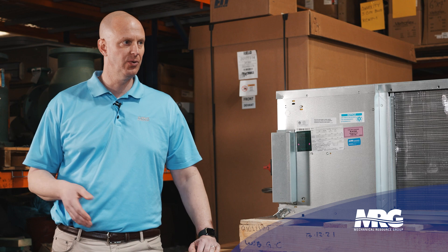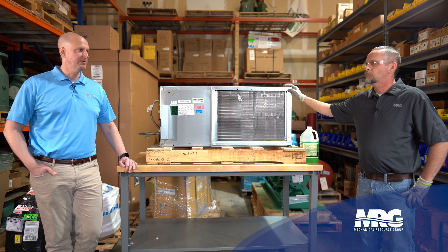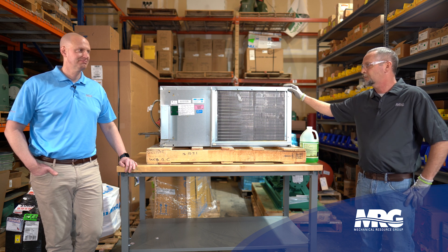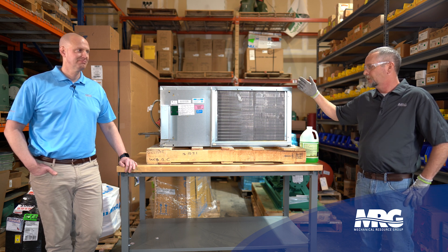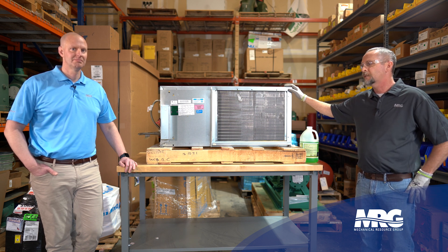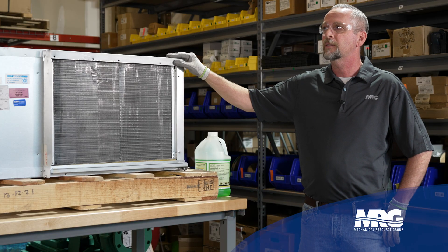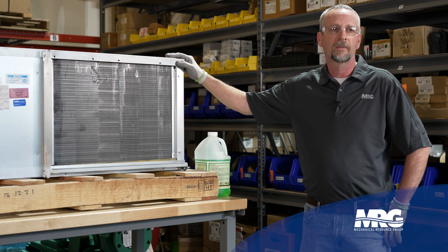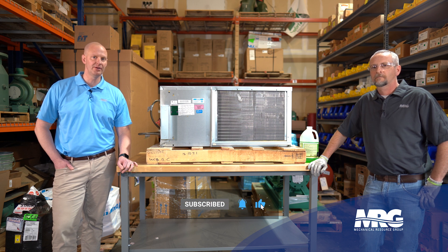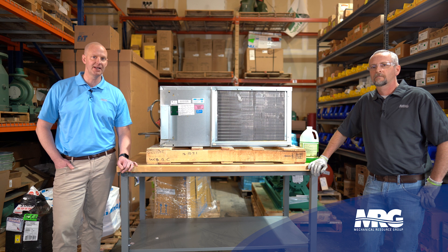This is more about making sure clients aren't getting mold growing on their evaporator coils or dust affecting efficiencies. We've seen it with first-year labor warranties — six months later we get service calls and it's nothing wrong with the gear, it's just packed full of drywall dust. People weren't changing filters like they should, didn't catch it on the front end, and then it switched to cooling cycle, condensation ran down over that dust, and it gets pretty ugly pretty quick. Thanks Brian — leave your comments below, hit like and subscribe, and check us out at Mechanical Pros.